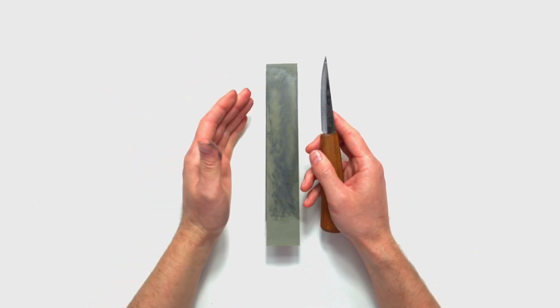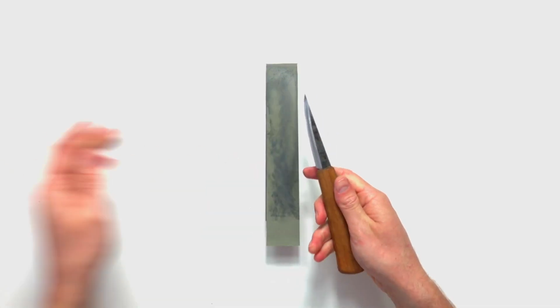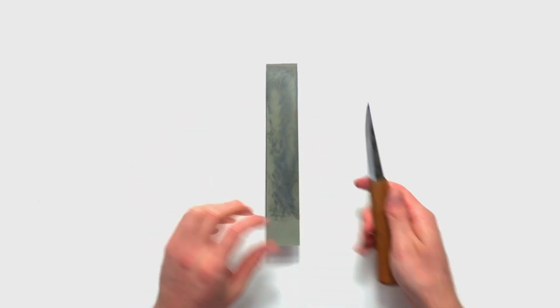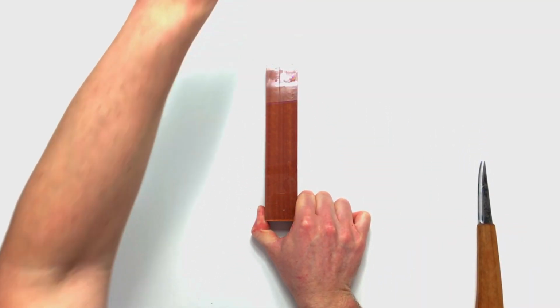We've removed those 1200 grit scratch patterns, or that scratch pattern. We're going to wipe the blade off again. Have another quick look at the bevel. You can see the tram lines that we've got going on there, and it's now slightly more polished. Now we're going to pull this up. Again, no mess, no fuss, no need for any acetone or anything.